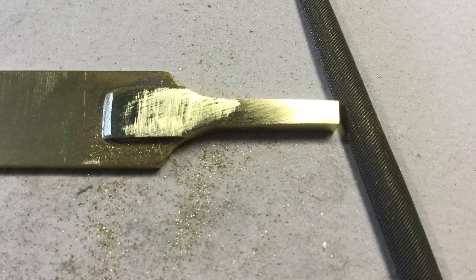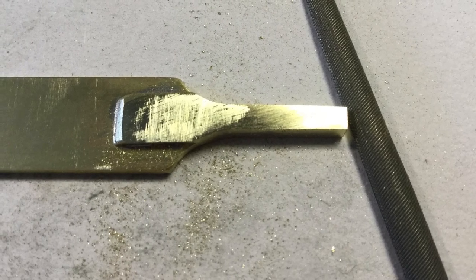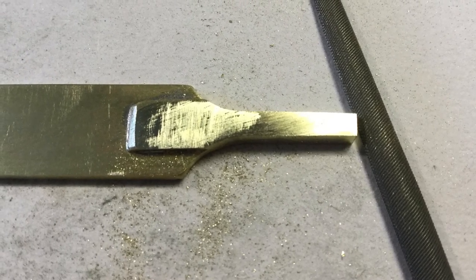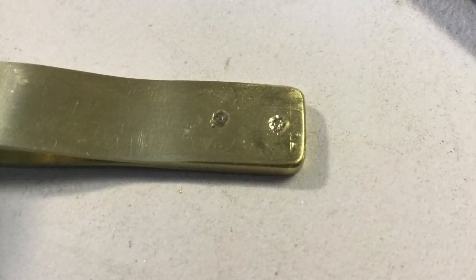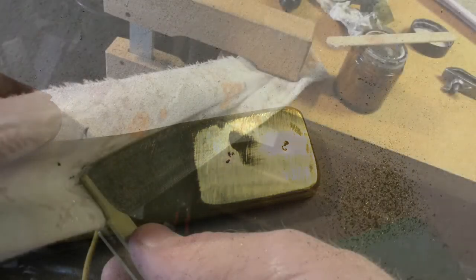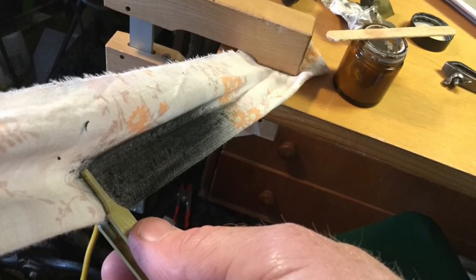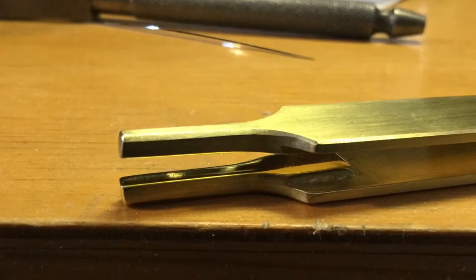When you're endeavouring to accurately file something flat, aside from the constant fitting and refitting of the relevant parts to each other, regularly change the direction you're filing the surface. Having an angled light on the surface will immediately show up where you're filing. Here you can see I've just finished filing lengthwise along the jaw and have switched to going crosswise. Being tapered pins and tapered holes, it only required a light countersinking at the smaller end. The pins were then riveted over with a small domed punch. Filing and sanding brought the end of the handle and the rivets down to a nice smooth finish. After the edges of the jaws were very slightly rounded and the surfaces given a fine sanded finish, I wiped some metal polishing cream on both sides of a double layer of flannelette. Then closing the jaws of the tweezers over the cloth, whizzing backwards and forwards and pushing upwards and downwards as you go, gave a really good finish.